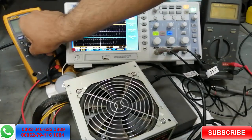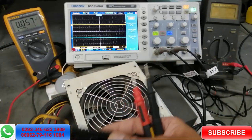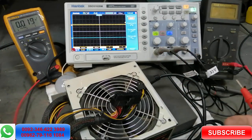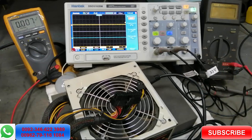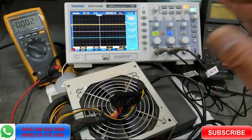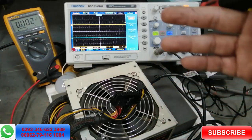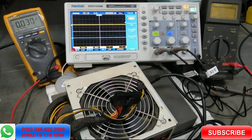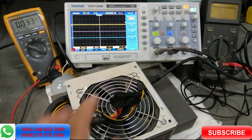Set the multimeter to DC. This power supply is divided into sections: the first is the input filter circuit, second is the rectifier section, third is the standby power section, fourth is the pulse width modulator section, next is the output rectifier and regulator circuit, and then there is a feedback, overload, and over-voltage protection monitor.